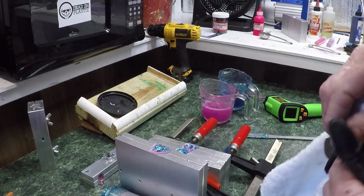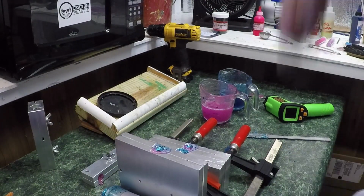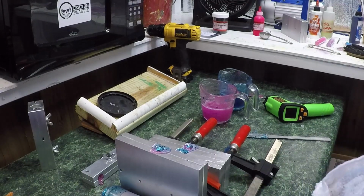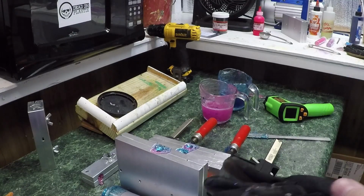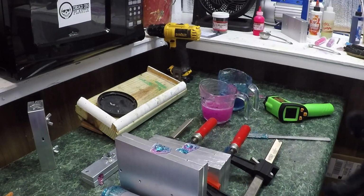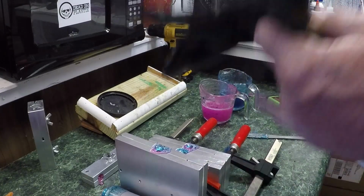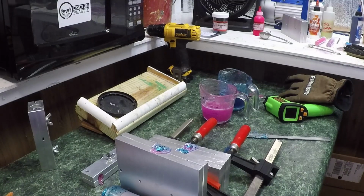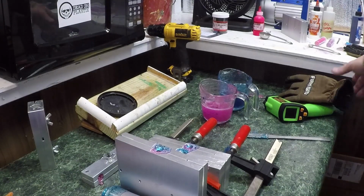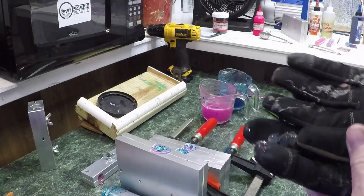But if you don't have gloves on this hand where you're handling this, I didn't. And I should put a glove on this one. But it's up here on the handle, away from the plastic. Not putting this hand close to the plastic. But if it squirts out somewhere on you or something, it's good to have. If summertime, I ain't gonna put long sleeves, it's too hot. But if you can wear long sleeves, you're better off to. And you definitely have gloves. I seen somebody on YouTube the other day pouring without gloves, and boy, I've got it on my gloves so many times. I mean, look at the gloves. Those would all been burns, right?